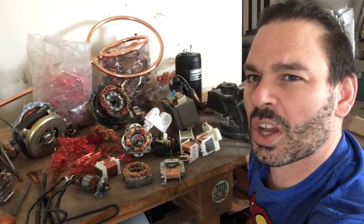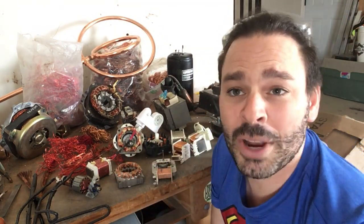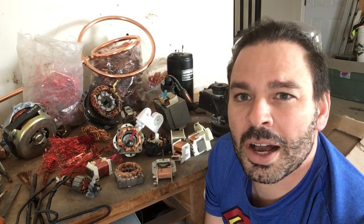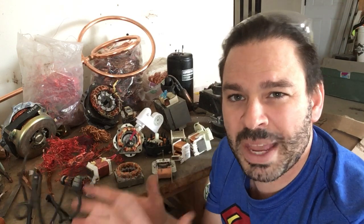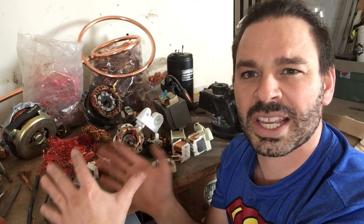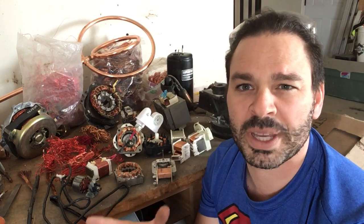So what I'm going to do today is I'm actually going to do a little bit of a test. I've got, as you can see on my table, a number of different examples of copper and things that look like copper but are actually not. I'm going to try and test your knowledge a little bit and give you some tricks and tips to help you maximize your profit, identify the copper, and more importantly, make sure you keep it separate from your aluminum. Because if you bring in copper bearing motors and wire — some copper, some actually aluminum — you are going to get penalized if you throw it in your number two bin copper, which is currently $3.50 Canadian. But if there's aluminum in there, you're going to lose significant price on that because it is going to be classified as a dirty load.